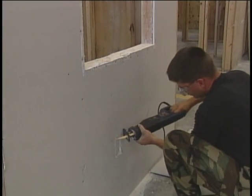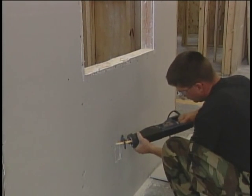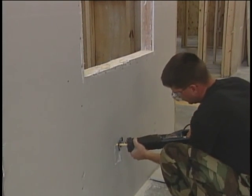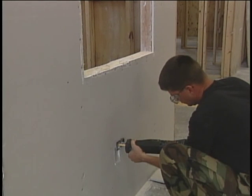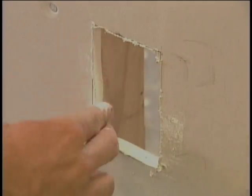In our particular case, we have an electrical outlet laid out to cut. It's a lot easier on the blade to cut in straight lines than try and turn the sharp corners. Cornering action puts a lot of unnecessary pressure on the blade and will shorten its life.